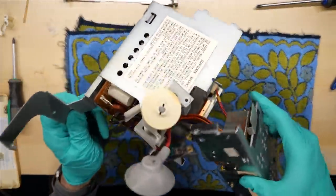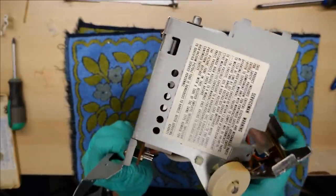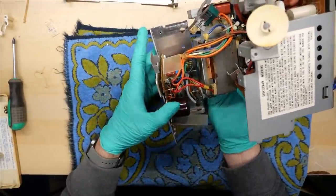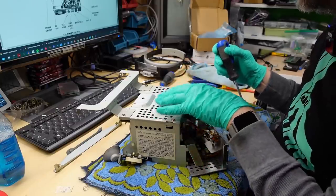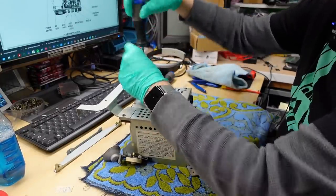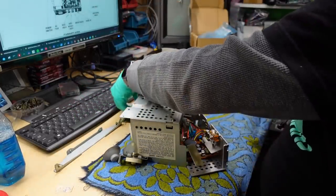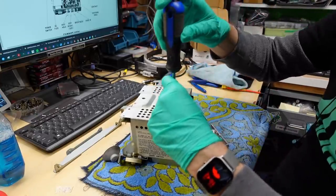Let's take a look at this chassis here. The first thing I'm going to be looking for are bad solder joints, because that's a pretty common problem with CRTs. I'm going to try to disconnect this, but it doesn't really come apart. So this is a transformer right here — line transformer — probably down to 12 volts. And then this board here is a bit of a power supply. I want to get to the PCB that's under this cover here. Weird — the Sam's manual, which I have up on my computer screen, doesn't seem to match this at all. Completely different. So I'm just going to have to start taking screws out until I get to the part I need.